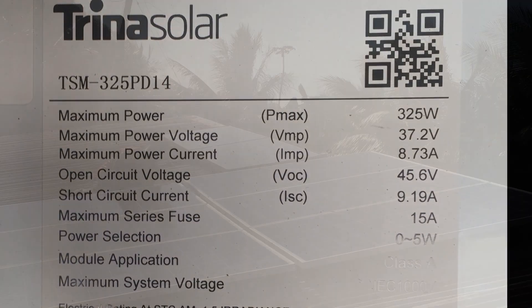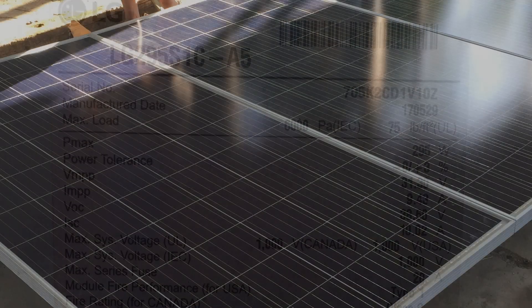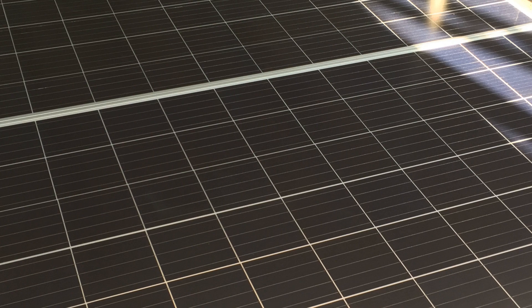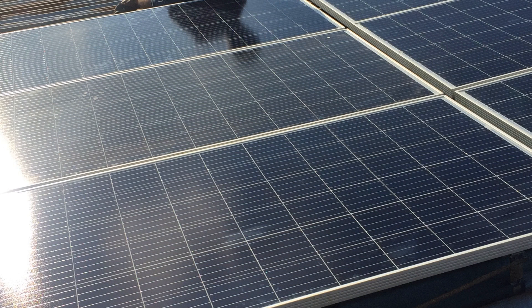They're supposed to be about 84% efficient — that's from what you get on the roof versus what you actually get. What I've experienced, though, is that on a clear day I can actually get almost 90% efficiency. The panels themselves are probably only 18 to 22% efficient, but from panel to inverter, I'd say these panels are pretty good — 90% is not too bad.